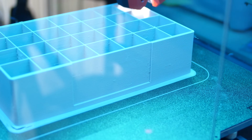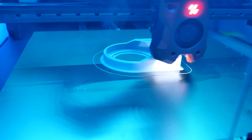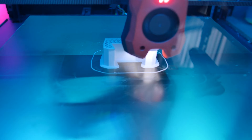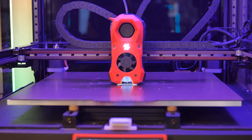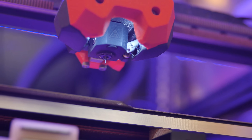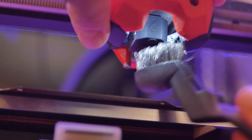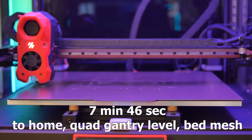The difference is quite obvious just by putting your hand inside the printer during printing. Some of the ABS parts I printed warped terribly as if they weren't in an enclosure at all. Lowering the exhaust fan to 30% seemed to do the trick — no part warping while also being effective enough to eliminate the ABS printing odor. TAP kind of sucks. It's slow and the nozzle has to be perfectly clean to home, level, and bed mesh. Most materials want to ooze at least a little bit during warm-up and after printing, so you have to be hypercritical about keeping your nozzle clean, which is just a bit tedious.